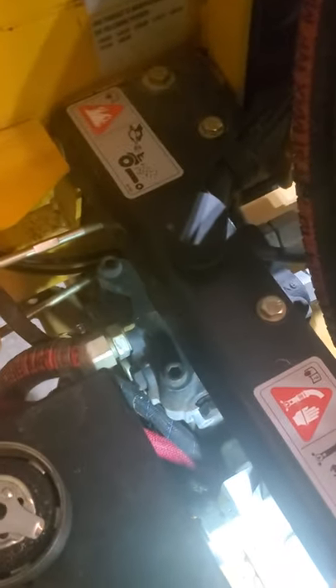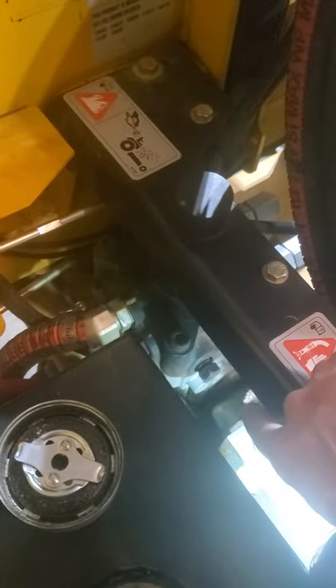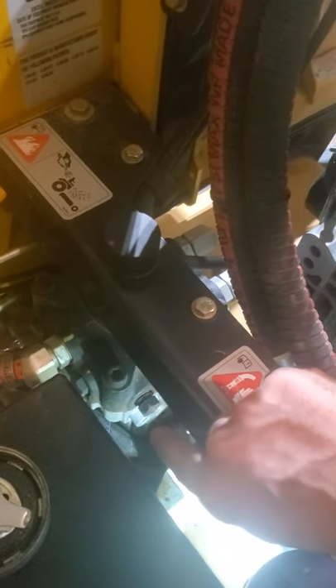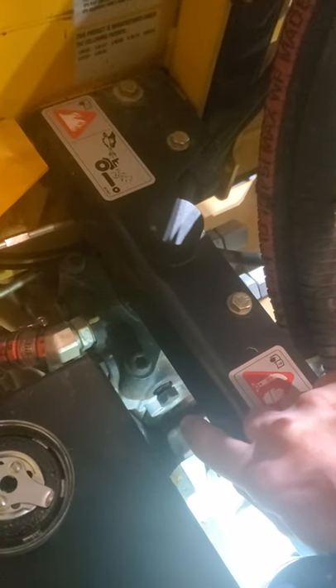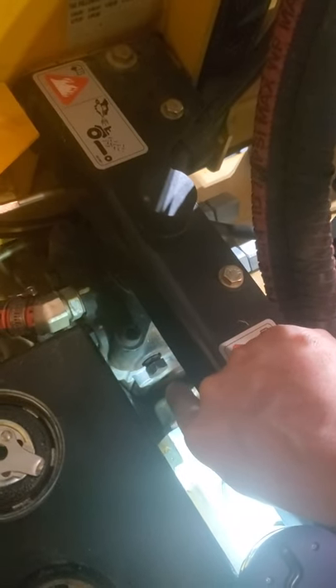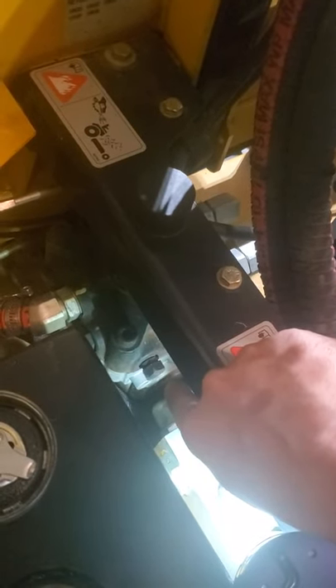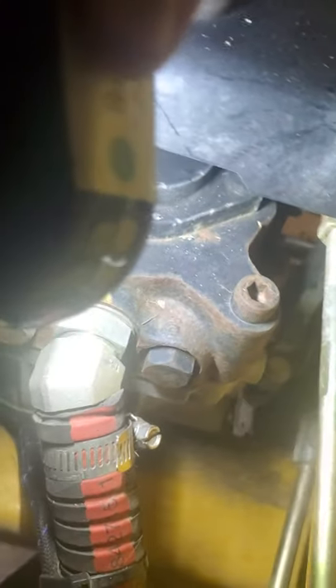The manuals are online if you care to read them. Here's a bypass valve — you fill it up, top it off, then the manual tells you to open your bypass valves. There's one here; I believe it was a 17 millimeter, which is kind of odd since most bolts on this machine are standard. The pumps must be a different animal that they buy from somebody else. I backed that out about three-quarters of the way — it will come all the way out, but once I discovered that I just turned it a couple turns back in. There's another one on the other side, same position, and that one was easier to get to from the bottom.